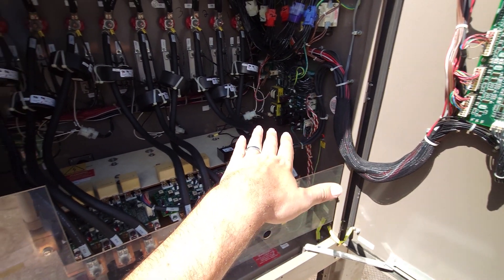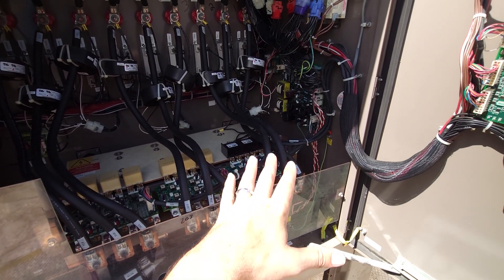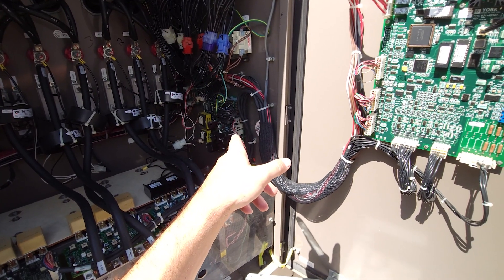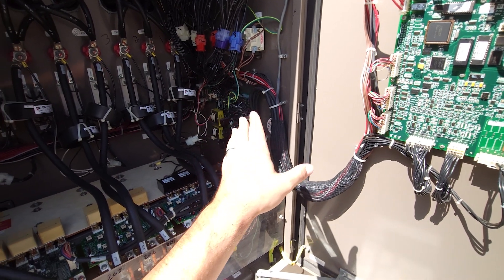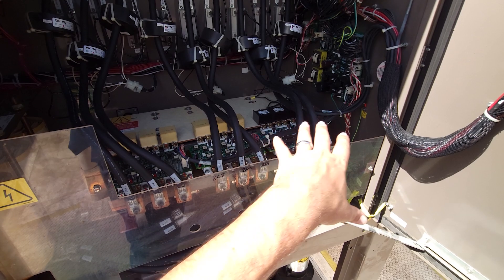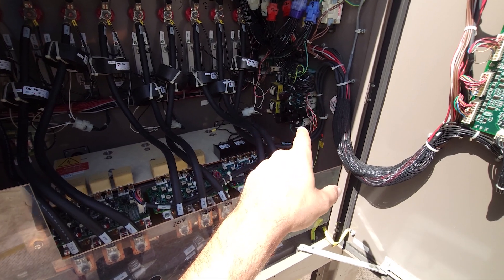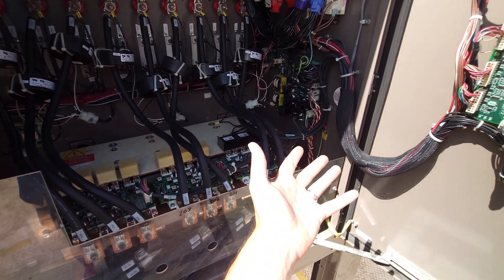It's very consistent — all three had the exact same conditions, and it happened over an overnight period on the weekends. I'm heavily leaning that the relay board or the trigger board is the primary issue, and it did not enable the IGBTs like it was supposed to. So they may have been getting a command signal to do something, but as far as the IGBTs were concerned, the trigger board never actually activated them.